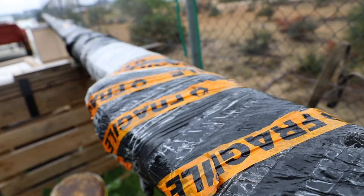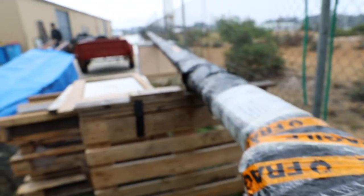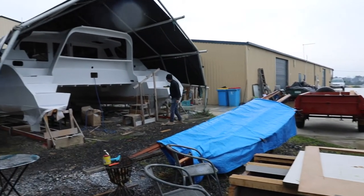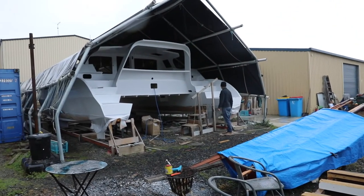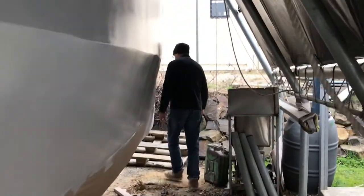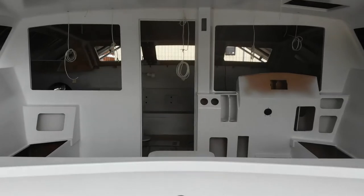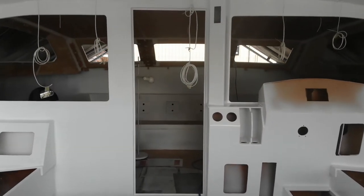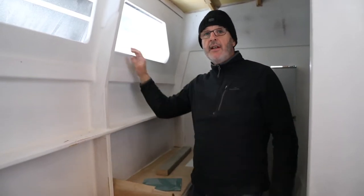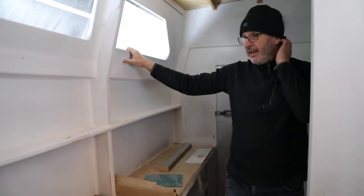The reason why these are structural is because, as I said earlier, this is 9mm — a thin wall. This is basically a fuselage like an aeroplane. The flip side of having a thin-skinned boat is that you need good structural elements to stiffen it — not so much from wind and wave action, but primarily for when you're sitting alongside a jetty. Because if there's a bit of slop, you've got four and a half tons working at a point load with a couple of fenders. So you need to make it strong enough to handle that sort of load.